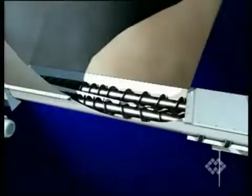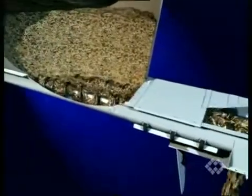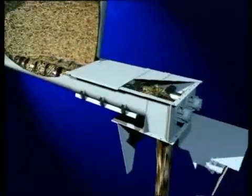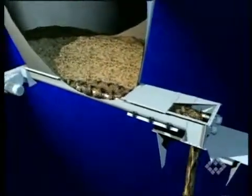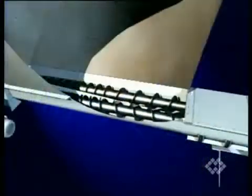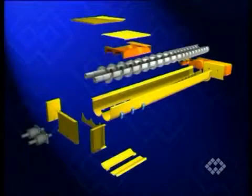The BU-type twin-shaft screw feeder has been specially designed for transporting materials like bran, soya flour and sawdust. Its tapered inlet trough follows the shape of the inlet sections of the screws, enclosing them almost completely from below. This type of screw feeder is preferred by users who do not wish to have material residue in the feeder trough.